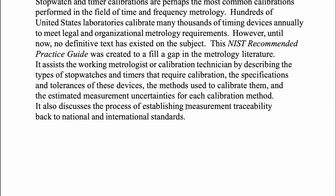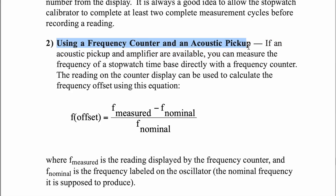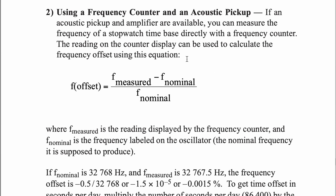I should be clear that what this software really does is compare the clock in your watch to the clock in your computer. Of course, the clock in your computer is also not calibrated, so you have to take these measurements with a grain of salt — you certainly couldn't use this software for legal metrology, at least not without calibrating your computer's clock. As a side note, if you had some watches that you independently knew the timing error of, you could use those to get the calibration curve for your computer. If there are any of you who would actually use this software and have suggestions for improvements, features to add, or data you could send my way for testing, I would be happy to hear from you.